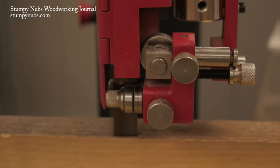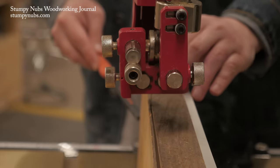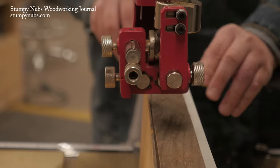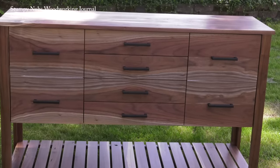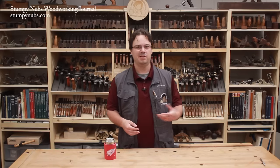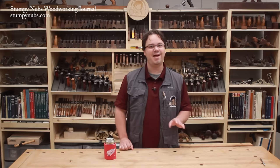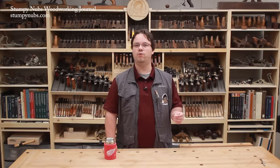And many bandsaws will re-saw much wider boards than a table saw will. The ability to re-saw will change the way you work. You'll make better use of your materials and you can create stunning projects by book matching homemade veneers. There are all sorts of cool things you can do with a bandsaw, from milling logs to cutting circles to preparing turning blanks. But not every bandsaw can do all of those things — there are certain things you need to look for in a good saw, and it pays to know what you want to do with it before you buy one.